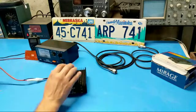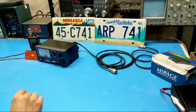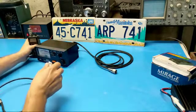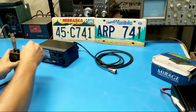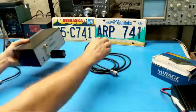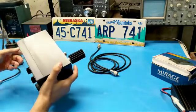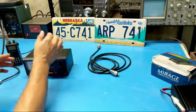Before I hook up the amplifier, I think what I'm going to do is hook up the HT and test it out to see what power we're getting out of the HT first. This is my dummy load right here — an old Radio Shack dummy load. It's good for quick key-downs up to 100 watts or so. We're only going to be putting 5 watts into it with the HT and then 35 or 40 with the amplifier, so we should be good. I've used that thing for years and it's done okay.